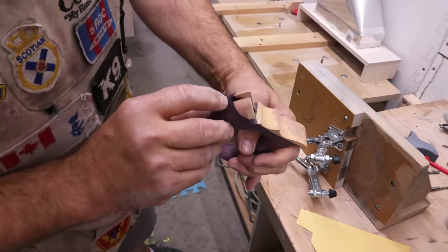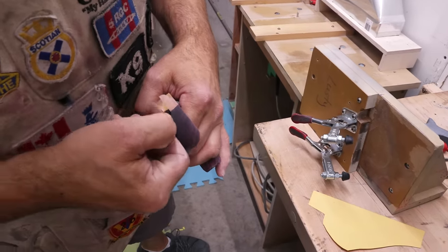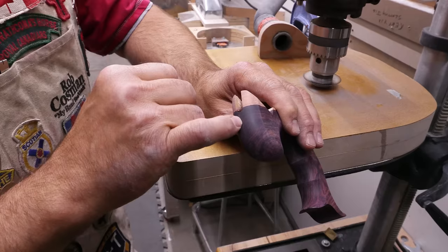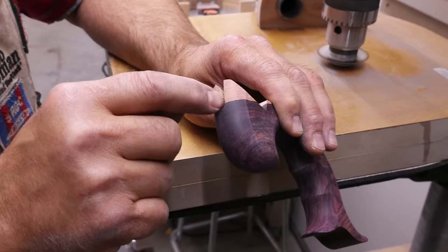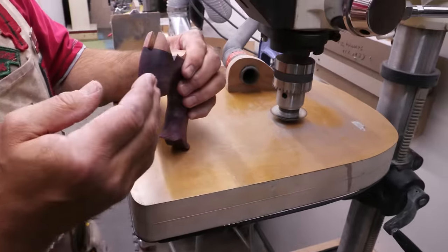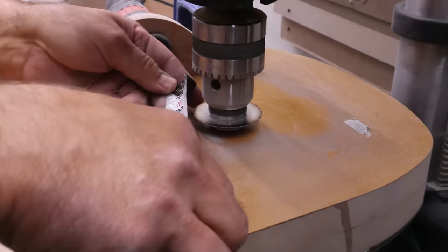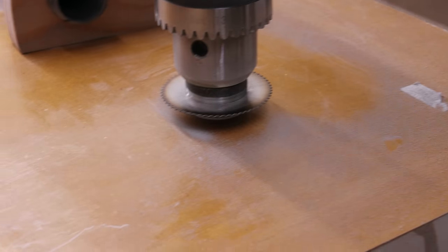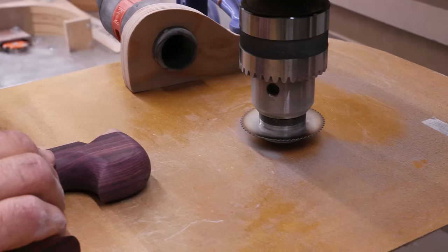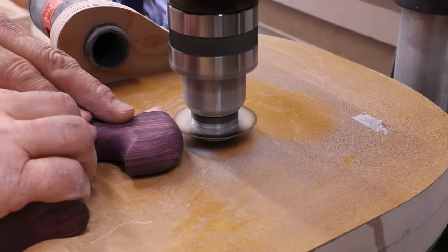That slot is cut to hold a dovetail saw — we've got the right depth. Now the next move is to cut our slot down through here. The slot that runs down through here to grab the bottom part of the blade has to be perfectly centered in this slot where the brass sits. We found that if we tried to do it with a band saw, it would sometimes wander. So we use a two-and-a-half-inch diameter slot-cutting wheel spinning in the drill press — just the right height, and somewhat of a dangerous operation because it has a tendency to grab, but get used to it. I just do it in multiple passes.